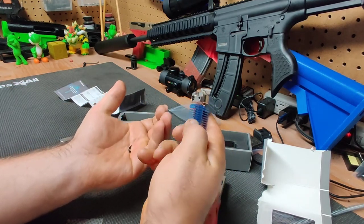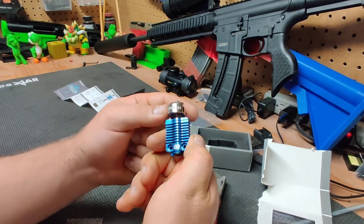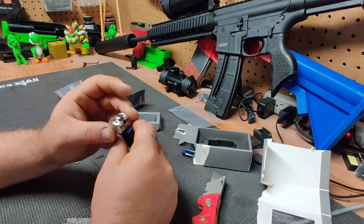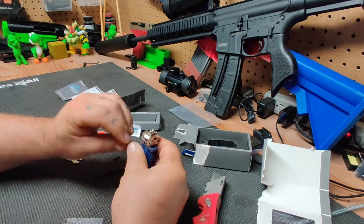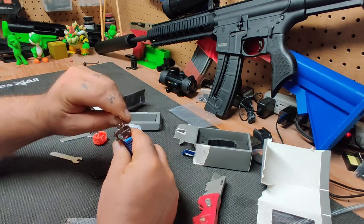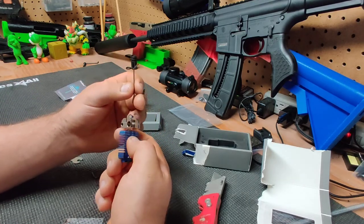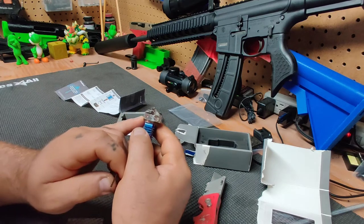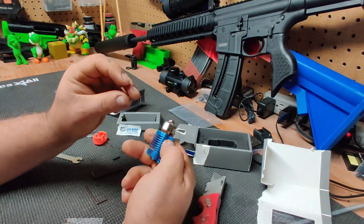These really tiny black screws go up under here and hold everything together. We checked and one screw was very loose, which is a good thing we caught. That screw was for the heater cartridge and the other one was for the thermistor.